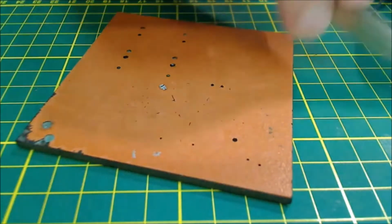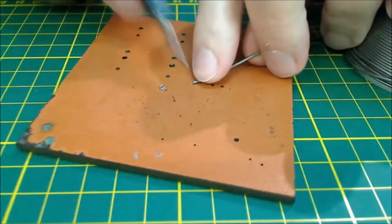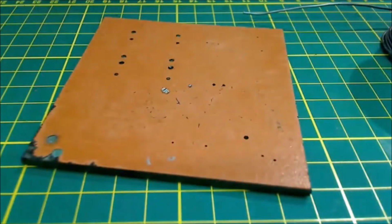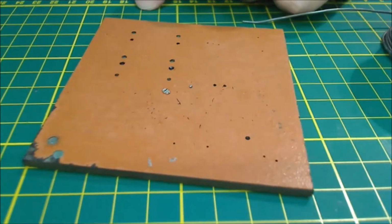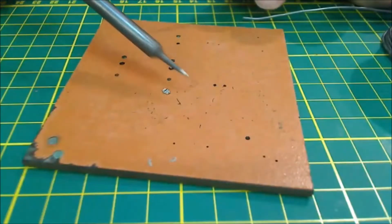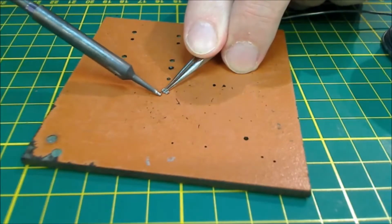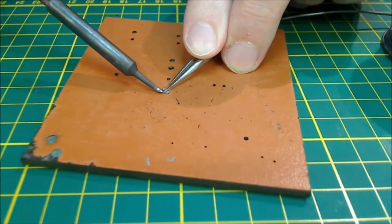And I'm going to introduce solder from the sides on the iron. So as I've done several times yesterday, get a little salami slice of solder here and get my iron and give it a good stabbing in my tip cleaner. It's oxidized, I've not used it for a while. I'm going to pick the solder up on the iron and then hold this down with my tweezers and put the iron into the side and try and get this solder to flow between the layers, not all over the top of the axle box.